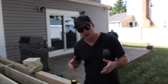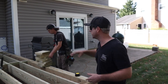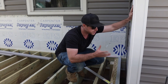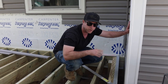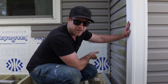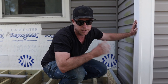We got most of our frame in here and we're starting to work on some of the blocking. Let me show you a couple of things we had to do to support the roof going on here, because we have this second story cantilever. Rule of thumb: don't build off of a cantilever. So what we have here is a tripled rim joist, which is essentially going to be a beam that supports our roof. We have a 6x6 post going right up against the house here, and that's why we need this helical pile right in the corner. We don't want the ledger board supporting not only the deck but also the roof. So we have footings on both sides to support that post, and our beam will go on top of that for our roof — we have four posts that are going to support this roof.